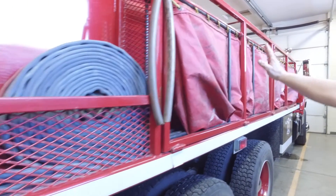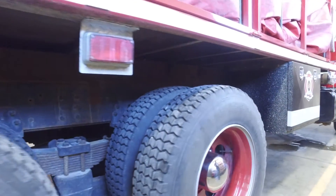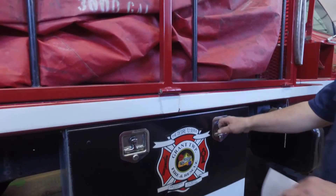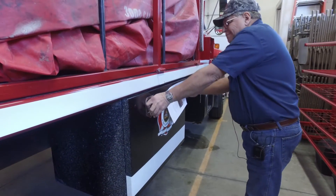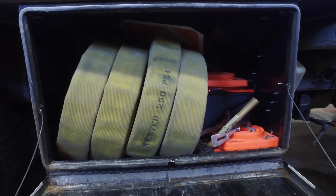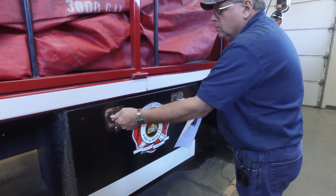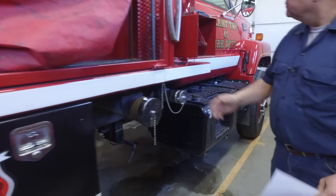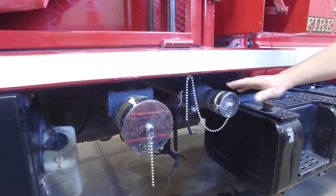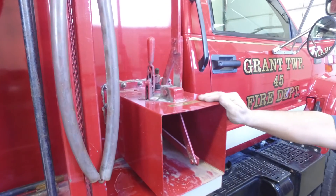Along the side we have a manually operated side rack. It has a 3,000-gallon porta-tank that goes with the truck. On the passenger side we have another compartment the same size as the driver's side, with plenty of room for hose storage — we have 2½-inch in there — and room for our cones. On the passenger side we also have a 4½-inch hard suction intake, a 2½-inch discharge, and the other 10-inch quick dump right behind the passenger door.